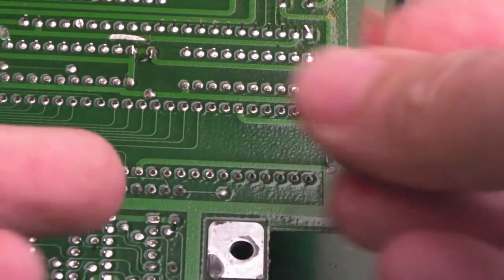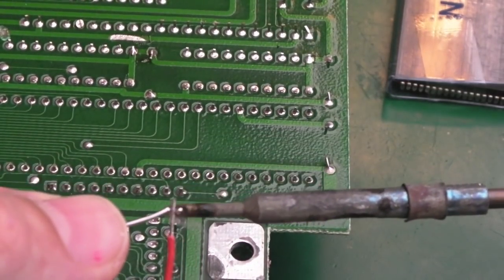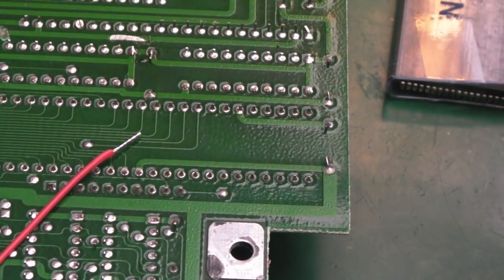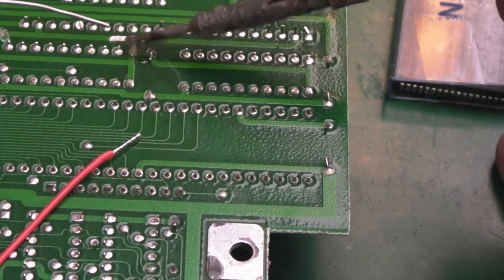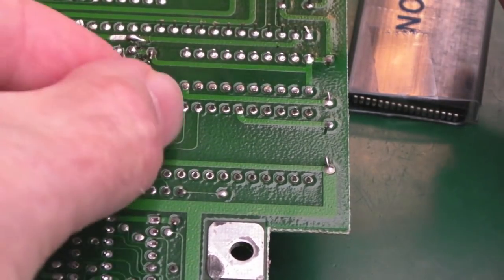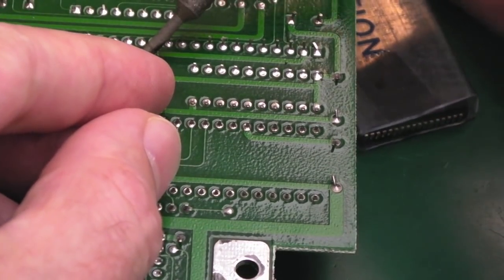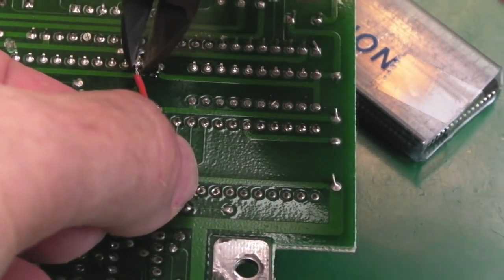As you can see I've got a piece of wire here, I've just stripped the end off. I'll just tin that up — the soldering iron is just about hot enough. We'll add a little bit of solder to that bit there, a little bit of solder on that pin. What I'm not sure about is why it's been removed — it looks like a factory mod, unless someone tried to do the same mod to two different boards and failed. Let's solder that there, pull this across and heat it — there we go that'll do. Bring the cutters in and just trim that there.